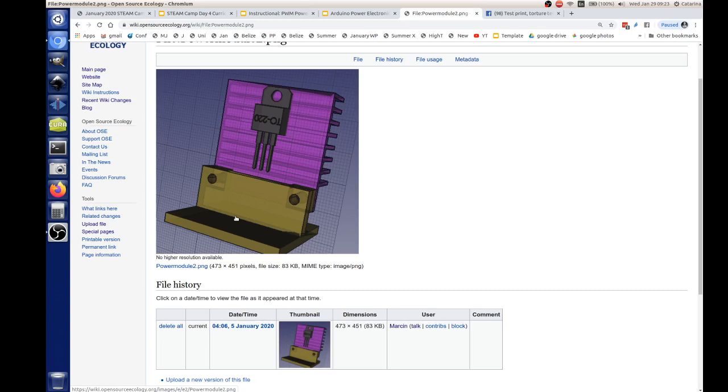So in principle, if you're running at 600 volts, 600 times 30, what is that? That's 18 kilowatts. So within the specs, if you can get 180 watts of heat out of this using our little cooling assembly, this little panel is handling large amounts of power, tens of kilowatts or so. That's a big welder.